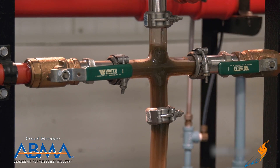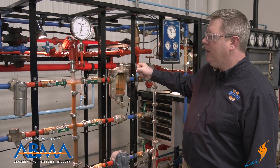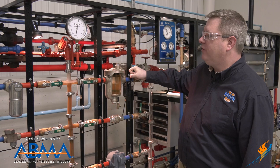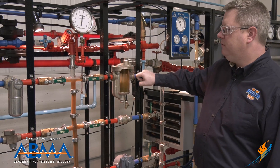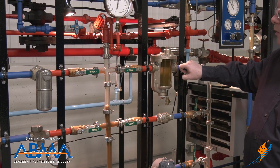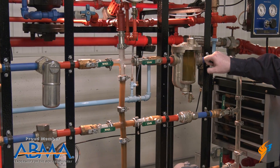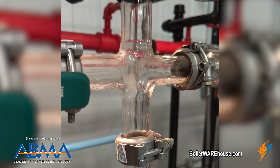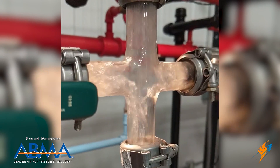What we're seeing here is the introduction of steam to this cold pipe. Any time we allow that steam to flow into a cool area we've got a potential for hammer. What we're seeing here are shock waves generated by the absorption of the heat by the steam and the basic implosion of the water into that space. It's actually the water refilling the space displaced by the steam that's causing the hammer sound.